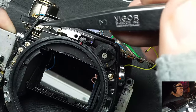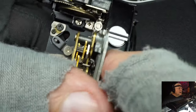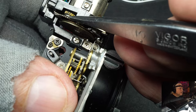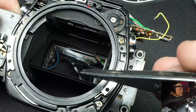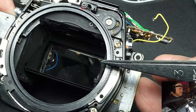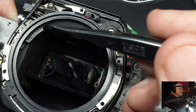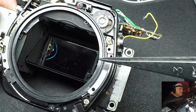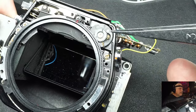This string is attached here, goes over the pulley right here, and then goes back and wraps around this wheel here. As you can see, even this wheel has a gear here and a gear here. It's attached to the galvanometer, which rotates it. The second part of this is underneath this particular ring - that's the second ring. When you change the f-stop, you move this up and down also. It rotates that bottom geared plastic wheel - both of them are geared - and it's connected to here.